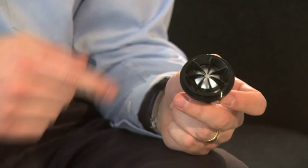Jack, Julia briefly touched on the tweeter earlier. Could you elaborate? The tweeter is the driver which produces the treble. For the T-Series, we've designed a large diameter voice coil side-vented tweeter with a tangerine waveguide. And this gives a very smooth treble, with wide dispersion and excellent imaging.